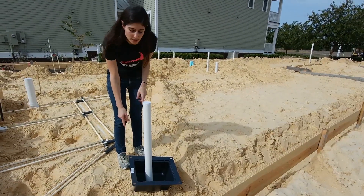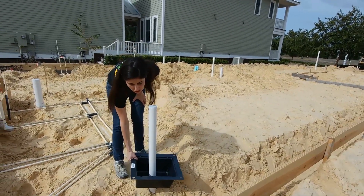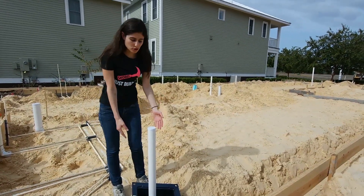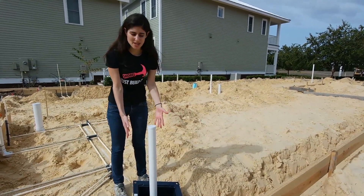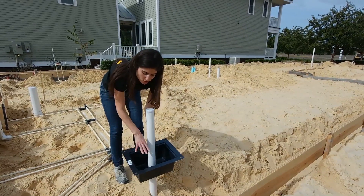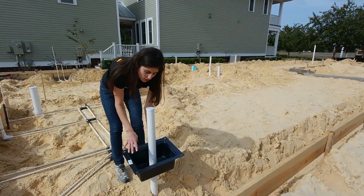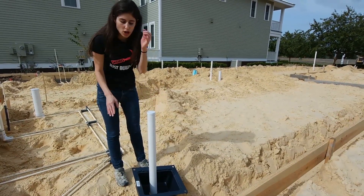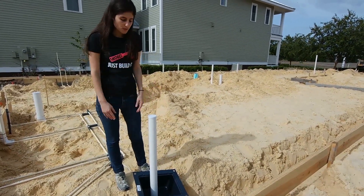This here is a future shower. They put this box here so that way when they're doing the shower there's a little wiggle room for where the drain can be. This box allows it so that when the concrete is poured there's an area that allows you to still move the pipe around during construction to allow some wiggle room for the drain.